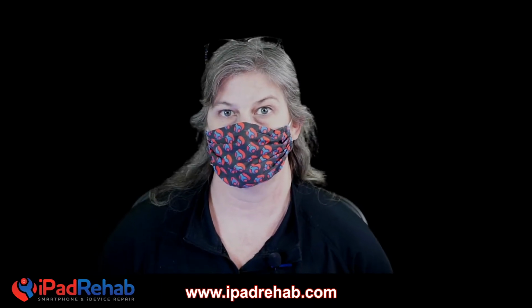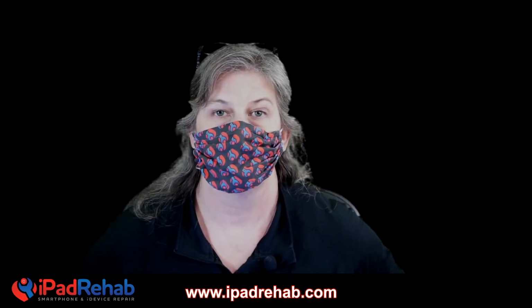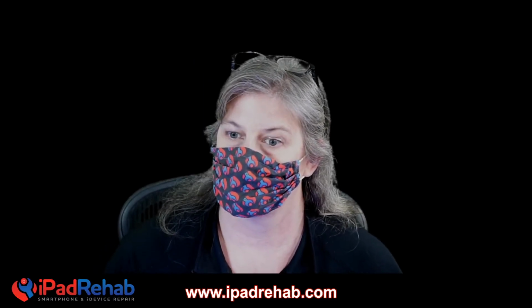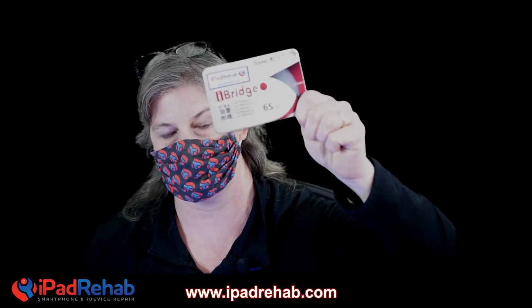Without the help of special tools, we are going to need to have touch, because you've got to enter the passcode, and only after entering the passcode will the device talk to tools that communicate by USB. Because of the USB restriction, we can't plug in any kind of dongle or keyboard. We're going to have to make this thing have touch. So how are we going to start? We are going to start by using the iBridge. This is where the iBridge really shines, and we're going to jump right into that.